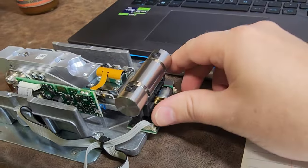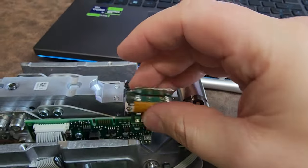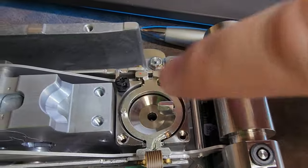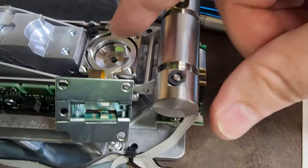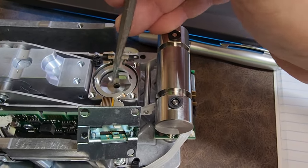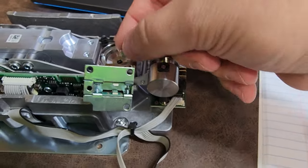There is definitely an electromagnet and that's why this thing is such a pain to get off. There is definitely a magnet down in here — it's very strong. The base is a magnet, and one of the things I've noticed is right here there was a coil going in and around, and I believe that this is wrapped. It is a coil and it is going to find a balance point — it's probably going to oppose the magnetic pole of whatever the permanent magnet is in there. There's definitely a permanent magnet right there, so it's probably going to be the same polarity and that is going to force this little lever up, which causes it to find a balance point.